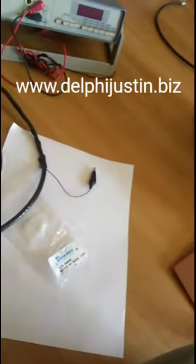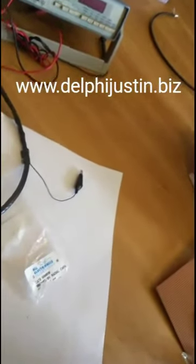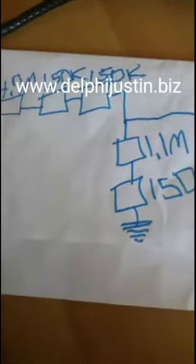That should be 6.25. If you get 5 megohms, then you have a problem, because it should not come around 5 megohms. That means you have a short in it. Even though it sounds close to 6, it's not. It's basically because you shorted out this resistor here. These here don't add up and then they can cause a problem. I decided that I wanted to make mine as accurate as possible.